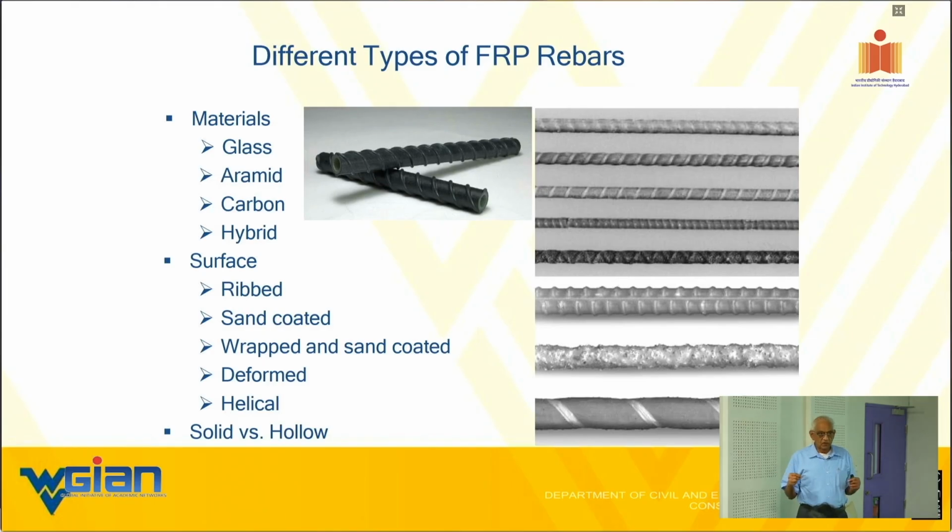Whereas when it comes to concrete, we are not satisfying all three of them. Of course, we must satisfy equilibrium. You cannot escape that. Of course, the stress is proportional to strain, which is the force-deformation relationship. But we are completely violating the compatibility issue. Why? Before you know it, concrete cracks. There's no way in the world you can now talk about strain compatibility or deformation compatibility. That's where we are violating. That's why I said concrete is a reasonable theoretical approach, but not a 100% mathematically definable, agreeable approach. So keep that in mind.